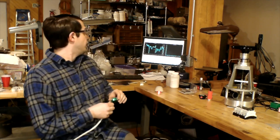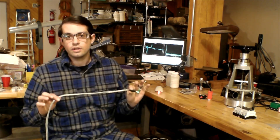This is a very nice device because our software is capable of taking the information off of this and putting it right onto your laptop or tablet without any headaches of trying to have data acquisition equipment, wiring, signal noise. The signal that comes out of this is entirely digital. So there's no concerns about analog interference, and in cases where you need isolation or long runs, fiber optic is definitely an option.